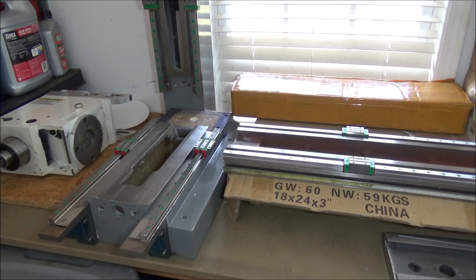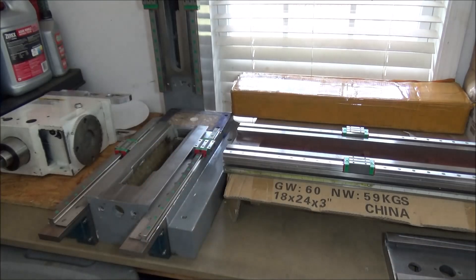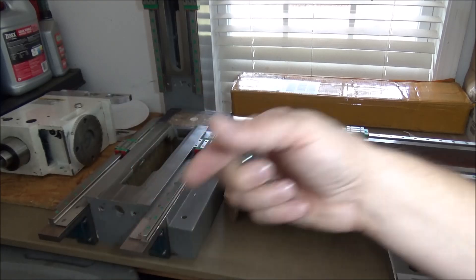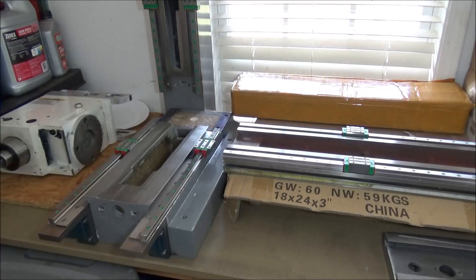The bushings I used to bore the holes worked. However, you do go through quite a few, so bear that in mind — what happens is the hole gets kind of oblong, so you want to make several of these. Once the bit starts to walk and waddle out, your hole's not as accurate. Unless you can use something hardened, like a hardened bushing, just make a few of them so you can swap them out when they start to feel like they're wandering.